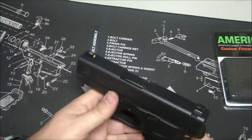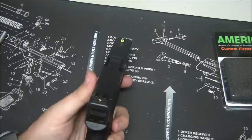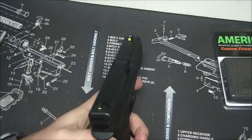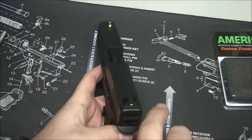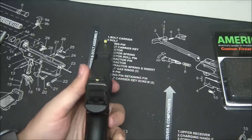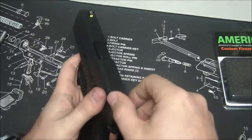The front sight goes in with the driver. For the rear sight, you simply drift it out — you'll definitely need a punch. I put the slide in a vise and drifted it to the right to remove the old sight and drifted the new one in. I'll put a link in the description to a video by Mr. Guns and Gear, who did a great video on how to install Glock sights. Just make sure you use a punch that won't mar your finish or mess up the sights.